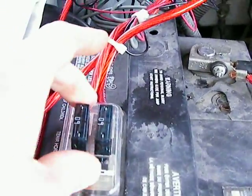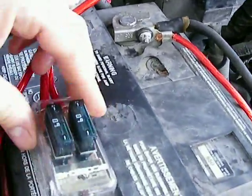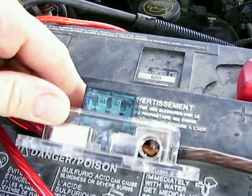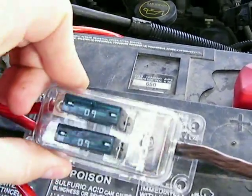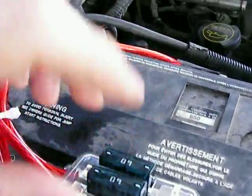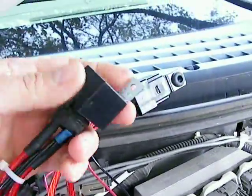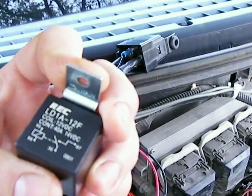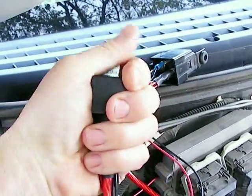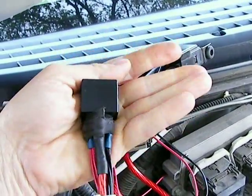I'm going to have to do a video on all the fuses I've melted doing this hydrogen stuff. This is the best setup I've found so far — these fuses are on metal and these don't melt so far. I'll let you know if we melt this. This is going to two relays — these are 40-amp relays. I don't believe it; it does say 40 amp on top, but I seriously don't believe it. When you run these things at 30 amps, they melt.